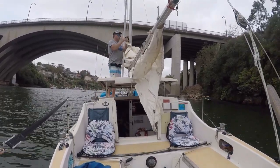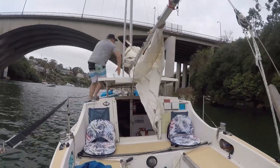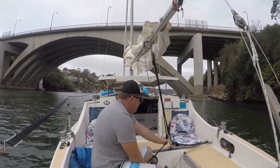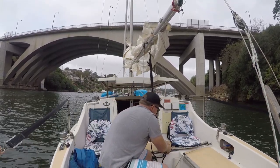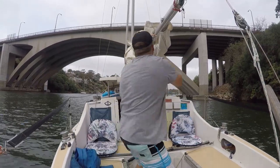From there, it's a simple hoist on the halyard to raise the sail, and don't forget to unattach the wire coming from the backstay to hold the boom in place. Of course, there's also the main sheet, the rope that goes down in the pulley, which basically applies tension to the mainsail. But you probably know enough about sailing to understand that that needs to be there as well.